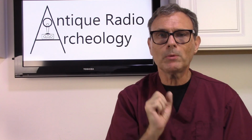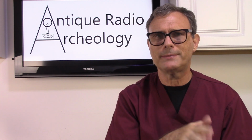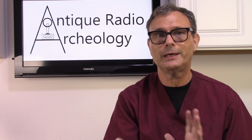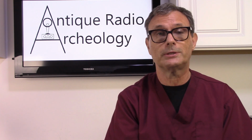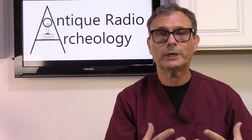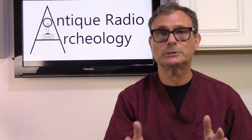But what was found was sometimes that wasn't enough, and you did kind of get low volume, especially at distant stations. And what you wanted to do also was be able to hook up a speaker to a radio, so you definitely needed some additional amplification there. Now, the correlation between a transformer and a tube as far as amplification goes is that they work together, really. And the purpose of a transformer really is to couple the stages.